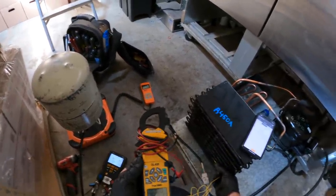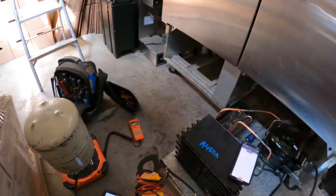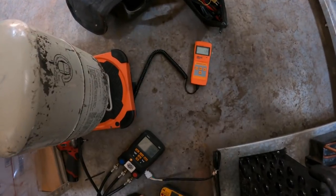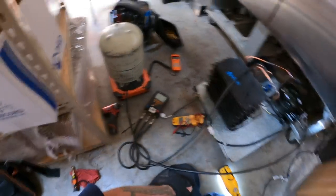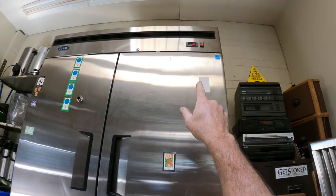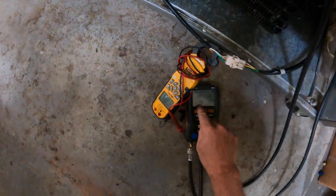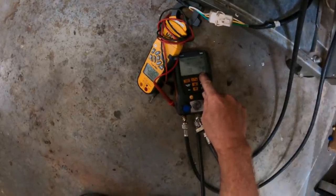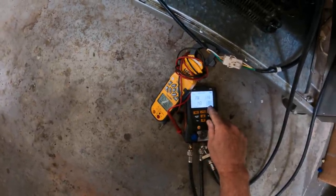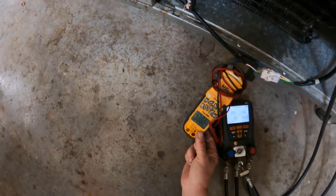So it's going to be 60 degrees going into the condenser, 59, 58, let's see, we'll call it 60. All right, 13.4 ounces. We'll see how that settles down and we'll see how that works. Got it turned on, we're at 48, dropping. And we're at a 19 degree evaporator, 114 condensing. It'll look like 13, 137.8. There we go. Yeah, 14, 138, 20 degree evaporator, 116 condensing.